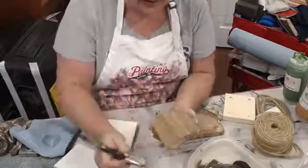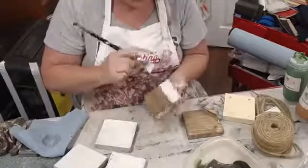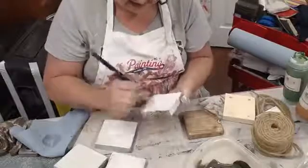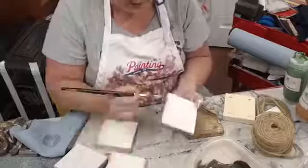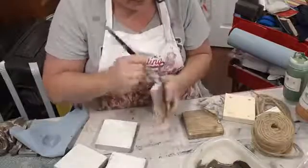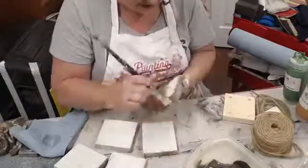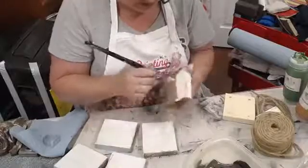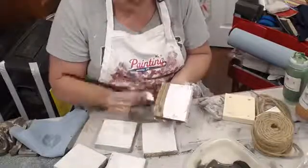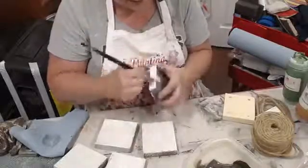For all the bleed through, if you get a can of the spray shellac, it's really quick. You can just go and spray all the knots, and it's clear, so you don't have to worry later about what colors you're going to use. You can just wing it. And it lasts a long time. It's kind of pricey. Actually, my son bought it. He was doing a project, so I had it. I didn't actually go out and buy it. I probably would have used Bondo, but it's quicker, because I knew I didn't need to worry about this part of the board, just the knots. So I just quickly hit all the knots with a quick squirt, and it worked really well.